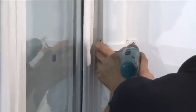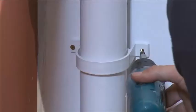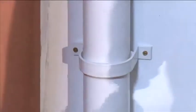Connect the downpipe shoe to the base of the downpipe. Fix the downpipe in position by use of the downpipe retention clips. They can be clipped over the downpipe and fixed into position with the screws provided. Note, to ensure adequate drainage, it is important that all round downpipes supplied are fitted.